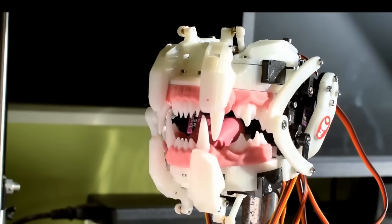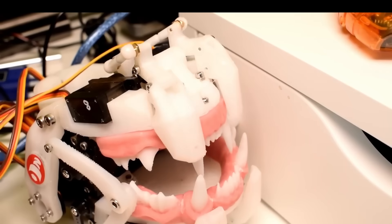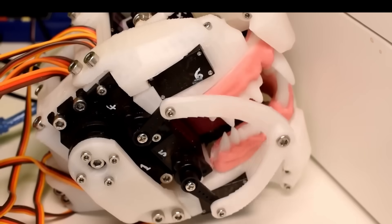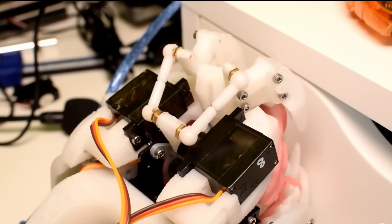With this design I started with the mouth. If you've been here for a while you might remember that I did a mouth mechanism project in 2020 which was a pretty successful design, but as a starting point I looked back on some of those design decisions to see how I could improve. There were a lot of good things about the design — I think the motors were arranged pretty efficiently — but there were certainly some unnecessarily long mechanical chains that could have been simplified, like the lip actuators which worked through a servo horn pulling a ball socket pulling a lever pulling a four-bar linkage. So this time I tried to simplify as much as possible.